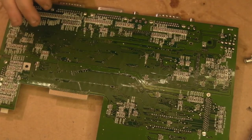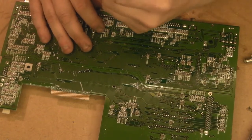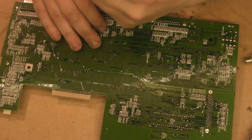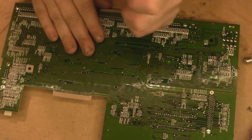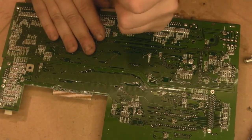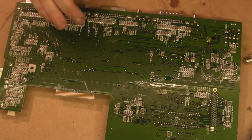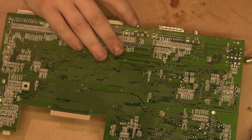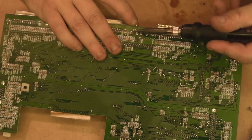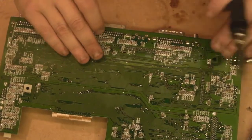Get my pliers and we'll just try wiggling them back. And back connections, make sure that they're free, because they feel quite free. And let's just make sure it's straight, because they do have a tendency to put a slight bend on these, so they're clipping the board as they go through the soldering process. Make it a little bit tricky for us to get them out. There we go. Right, that got it.